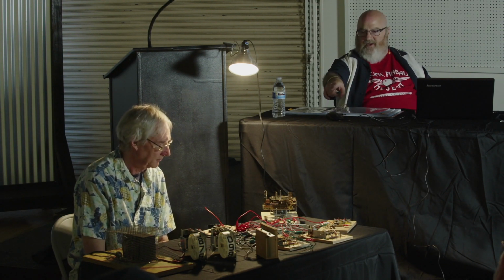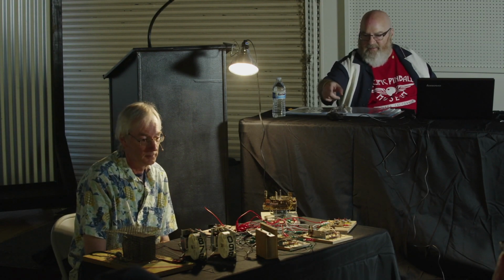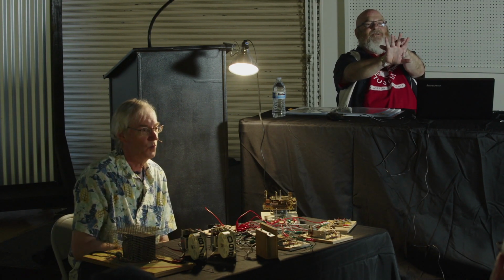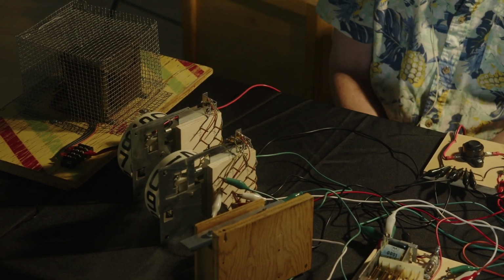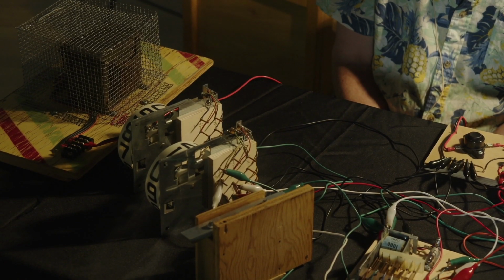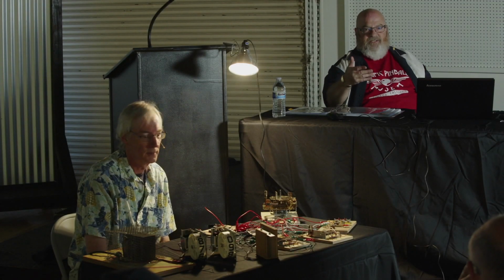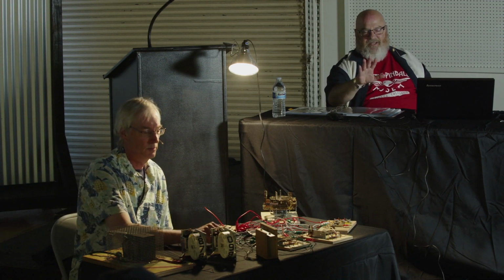If we tried to get the camera in really tight, Mark, maybe we can show the 9 switch. What you've got is an armature that's usually just moving these 2 switches here, and to get to 9, it pushes really hard. So a switch that's already closed gets very closed as it reaches to close the 9 switch. And that requires more effort from that spring. And you just end up adjusting the switches, and I've always been able to overcome it. I think that's what you were getting at.